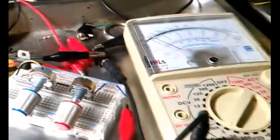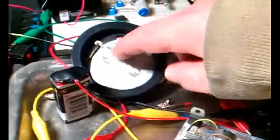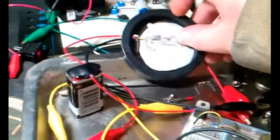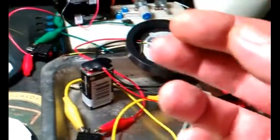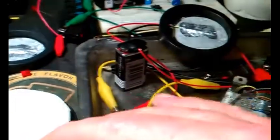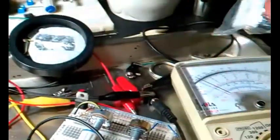But that's undesirable behavior in the circuit — I want it to be more stable than that. I thought, why is it doing that? Maybe this is just too much area, too diffuse for the current to find its way through that thick sponge. Maybe it just takes a while to build up enough to saturate, to find a pathway, and that's why the current was rising.